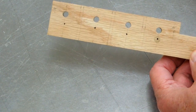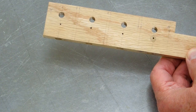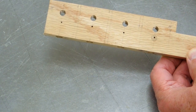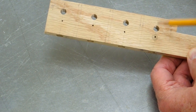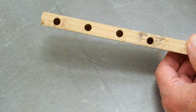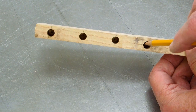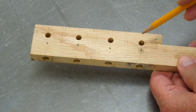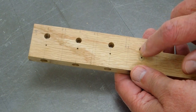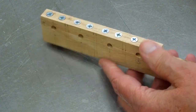This is going to be the upper end of my connecting rod. This will go on the connecting rod and this will be the rod cap. This is drilled quarter inch to run on a piece of quarter inch cold rolled steel. I drilled those with a brad point bit. This will go on to a 5/16ths wood dowel. I drilled a weep hole so when I put glue in here and put those dowels in while I'm turning them, that excess glue will come out this hole. Because I drilled this with a quarter inch brad point bit, it's fairly snug on that piece of cold rolled steel.